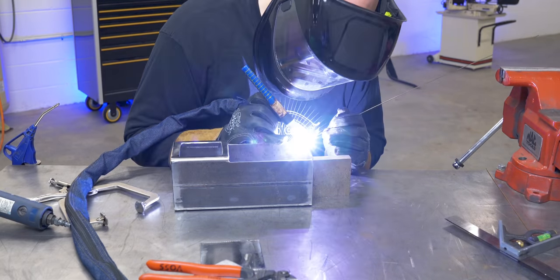All right, I think I'm actually ready to drop the rocket stove into the ammo can. The plan right now is to use the same spacers as before to make sure we're a half inch off the bottom. And then I'm just gonna mark around the edge, pull it out, pull the spacers out, and then take some of the ceramic insulation, which I haven't opened yet because it has a respiratory warning on it. So I'm gonna make sure I put a mask on for that. Drop it in the bottom, set the rocket stove back on top of it, and then get little pieces of steel and kind of tack those in on each of the four corners to hold it where it needs to be. That way I can position it and get it all locked in. And then drop in the rest of the insulation around the side and come back in and cap it all off with sheet metal.